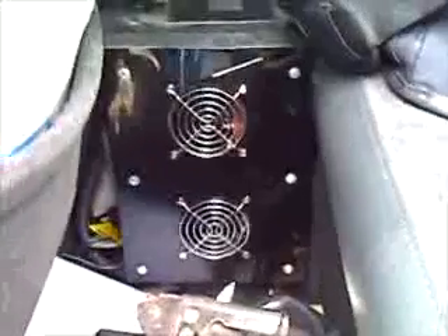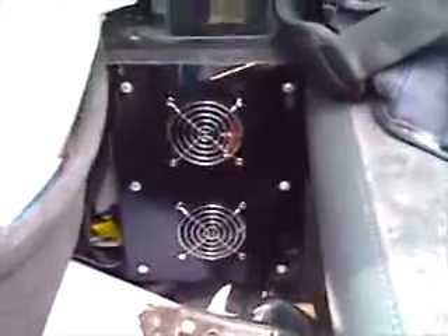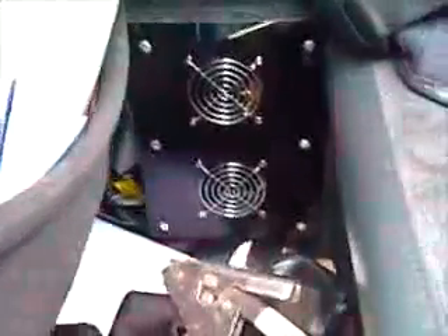I've been contemplating the idea of running one side of the 120-volt output of this inverter into a bridge converter, knocking it back over to direct current through a pulse modulator, and maybe trying 80 to 90 volts DC to the reactor cell.